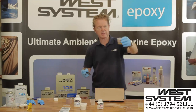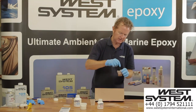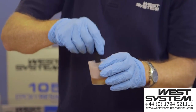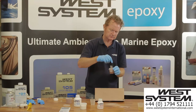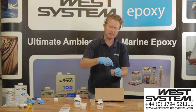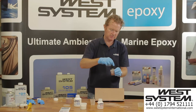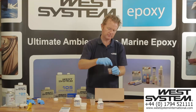And you'll instantly think, I'm going to struggle to mix this together. But if you persevere, I always find that if you just push the mixing stick in to start with, the filler powder doesn't fly away. It's important not to breathe this in. Just spend a bit of time. You have to have some patience just to blend the two together. And very quickly, we start to get a mix that is very, very firm, very much like smooth peanut butter, and suitable for making our fillet.